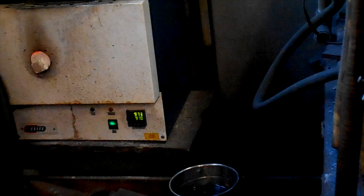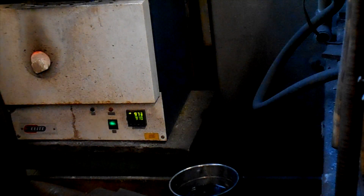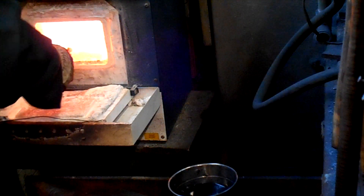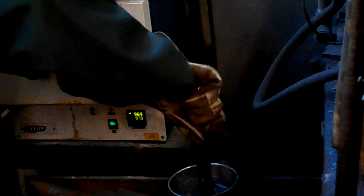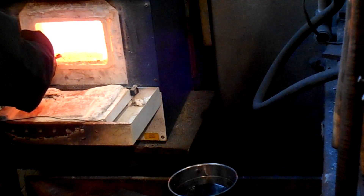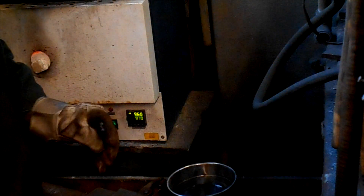The carburised punches are in here. Heat it up to about 970. We'll quench them direct into water. Take them out to break up the vapour blanket, otherwise they won't harden properly. There we are — three hardened steel punches.